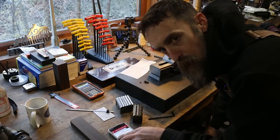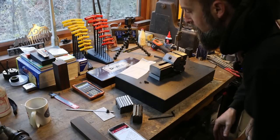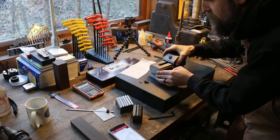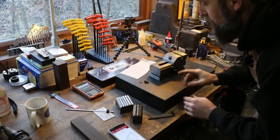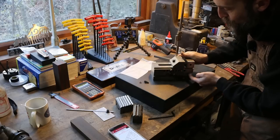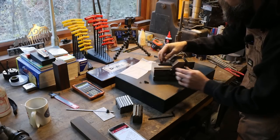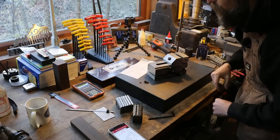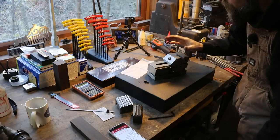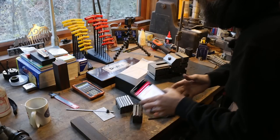All right, so now that all of my blades have been deburred, it's time to get set up with our fixture. This is a sine grinding vise. Awesome, by the way. If you have a surface grinder, you need one of these. This one happens to be 4 inches between the rolls. It is a 3-inch jaw width, and I think it opens up to 5 inches. I'm not exactly sure. Nice little sine vise. Nothing super expensive, but plenty accurate for 99.999% of the stuff that we do.